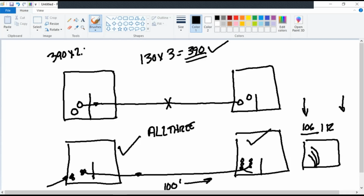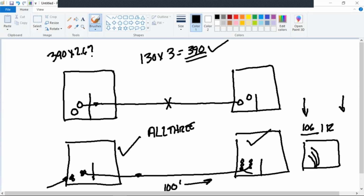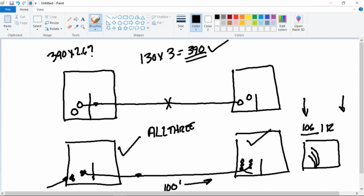Question real quick. If you do have the one damaged line in that 6-foot, 6-inch conduit and you replace all three, are you going to replace all the hardware as well for all three, or can you reuse some of that? Nope. You have to put new terminations on each end. Good question. On all of them. Yes. That includes all the terminations also. That's another cost. Appreciate you bringing that up, Paul. That's another cost. You can never reuse those.